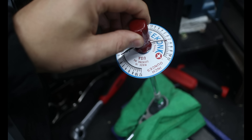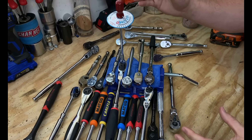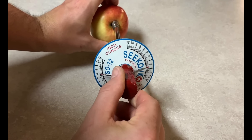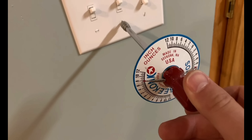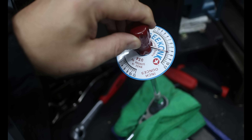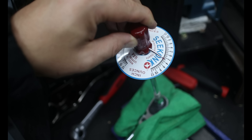Next we test back drag, measuring the spring tension internally — not the clicking, but the actual movement of engagement to remove or tighten a fastener. These forces are tiny, measured in inch-ounces. For perspective: twisting an apple stem is roughly 2-4 inch-ounces; a wall switch plate screw is about 8-9 inch-ounces. The Icon comes in around 5-6 inch-ounces, putting it in the top 50% for smoothness — not the worst, not the best. The Harbor Freight Pittsburgh is cheaper and smoother, but this one should be stronger and last longer.